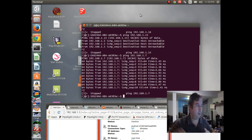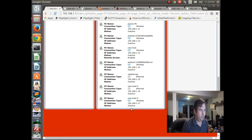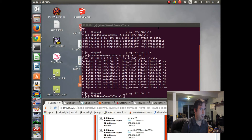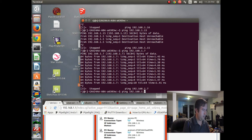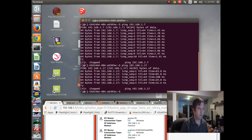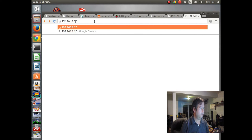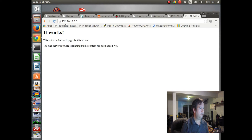Now when we go to the Verizon router, there's a new host - new host 5 - it's wireless, and it's under IP address 192.168.1.17. So it says there's a brand new host there, and if we go here and try pinging it, it's pinging okay. I can get out of this by Control Z. I actually put a web server on that, so we'll just check to make sure that is the correct Raspberry Pi device. Here's my webpage that I put onto it - it says it works. That's the only device that's got that webpage, so it looks like we're talking to it wirelessly now.